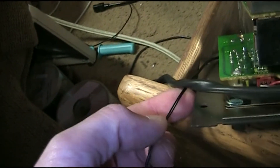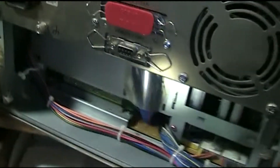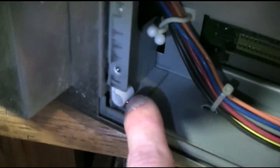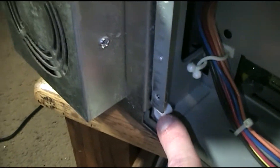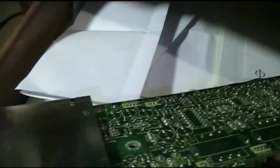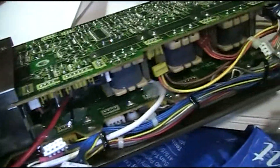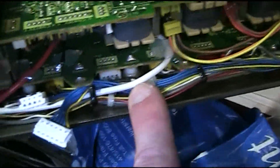The black wire is the control line for the dub, and this is the actual video line. They are going to be running out of this little cutaway right there — I did not do that myself, it was already like that. Interestingly, they've put a wire keeper there. I think that is where the cutaway goes over, so they've made some good provisions when they designed this thing. I need to do another continuity check just to make sure that this really shitty RadioShack wire didn't melt through and the wires didn't touch each other from only the temperature of the hot glue.